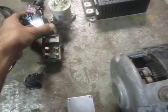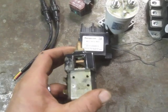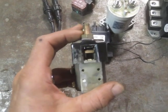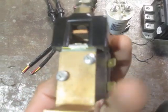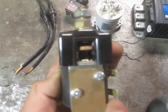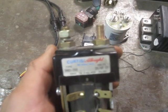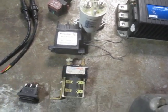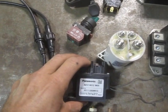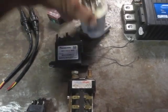There are a couple of others here that I thought I'd show. A contactor is just a big burly magnetic switch that pulls a great big copper bus bar down on a couple of contacts, and has the capacity to break the contact even if there are 400 amps running through it at the time. Ostensibly the best around are these Curtis Albrights — they're relatively easy to find on eBay. This Panasonic one I think actually comes out of the Chevy Volt battery pack, though I can't remember if the coil voltage is 48 or 12. And these are some Tycos that I had.